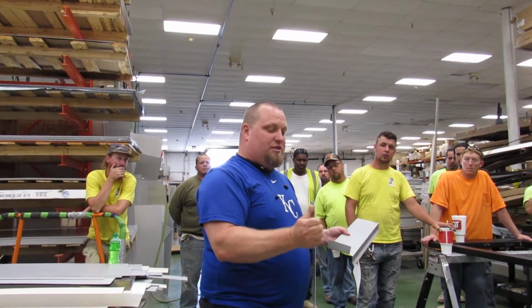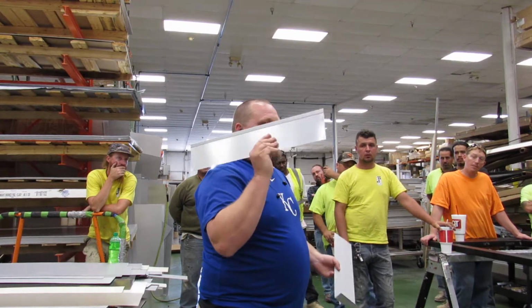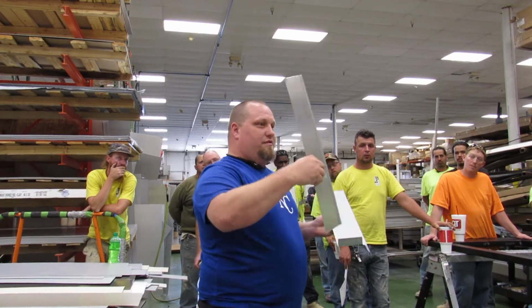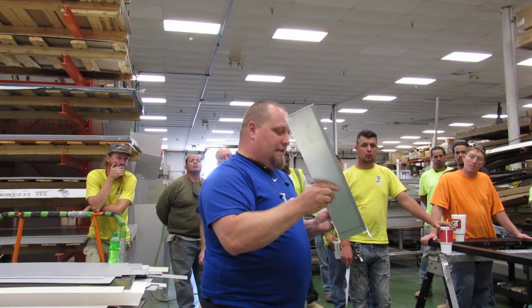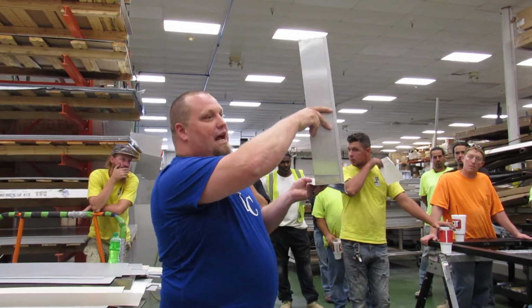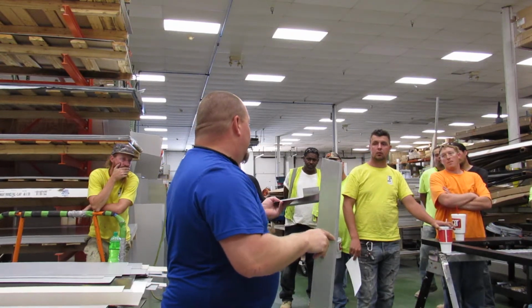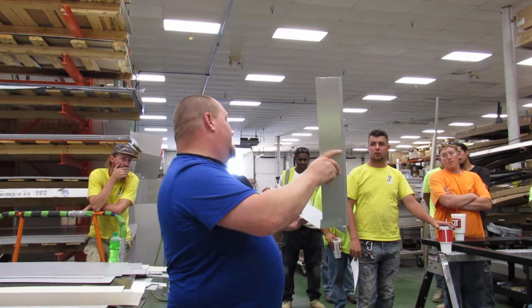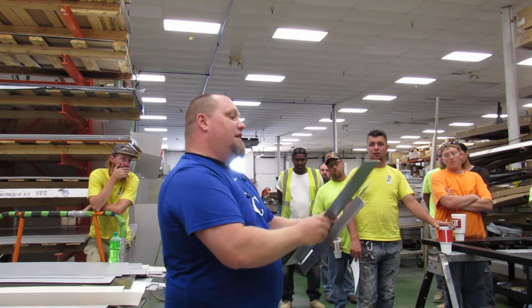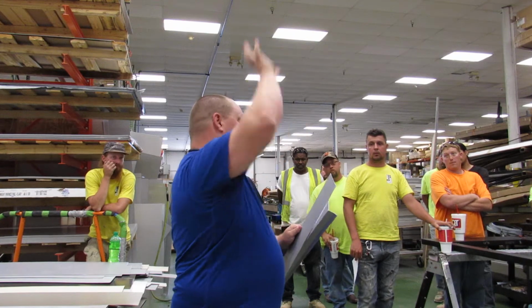And the reason for that is if your jamb metal is just flat, cut this a half inch short, the same as your hem, so it doesn't roll on you, and they can slide in together. And you still have the overlap. You have to have the overlap on this. So you always turn your sill metal up. Your jamb metal goes in next. If you're wrapping the jamb, your jamb metal then turns a tab on the head. Then your head metal goes on last.